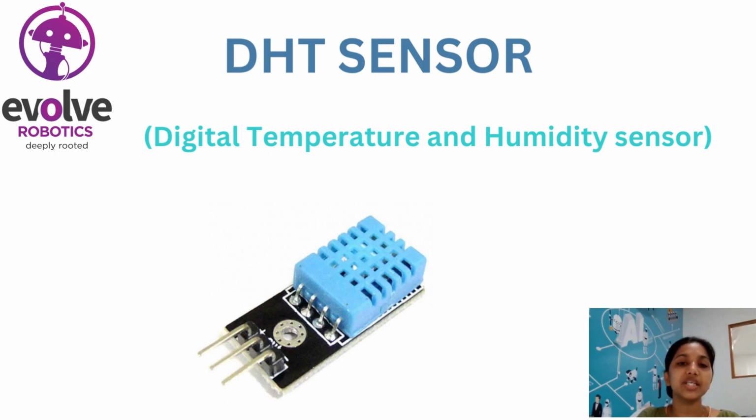Basically, this sensor has two parts. One is a capacitive humidity sensor part and the other is a thermistor. Thermistor means it's a temperature sensor. There is a basic chip inside to convert the analog value to digital, because our temperature and humidity are analog values. So there is a chip inside our DHT sensor to convert these analog values to digital ones.